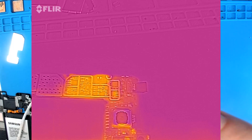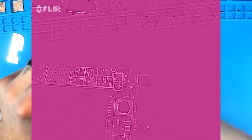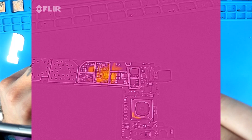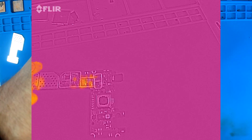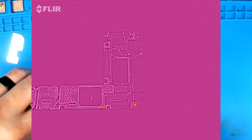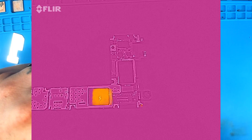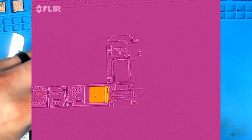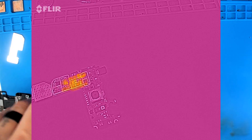What's getting hot? Kind of seems like everywhere there, right? Alright, let's flip it back over and we're gonna look at the top side again that has the CPU on it. Sure does seem like a CPU short, right? Let's look back at the bottom side again. I don't see any specific components getting hot. Well, in this case the heat's really spreading out quite a bit — this thermal camera is not doing me a whole lot of good.